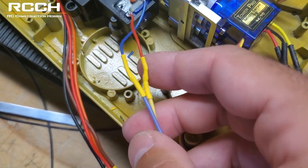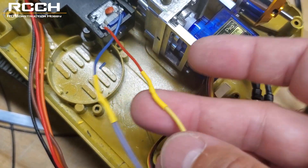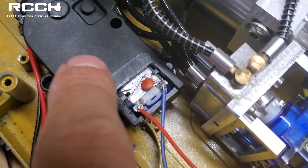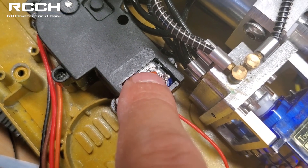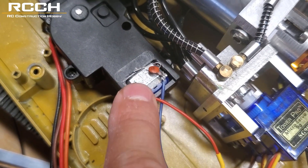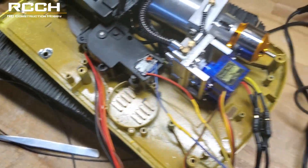Back to the slew motor — the rotating motor. The blue wire is going to get soldered to the blue wire, and the yellow wire is going to connect to the red wire. You may have different colors. I disconnected the small sensor component so it doesn't do anything anymore — I just need the motor to be the motor so that we're just rotating without any issues.